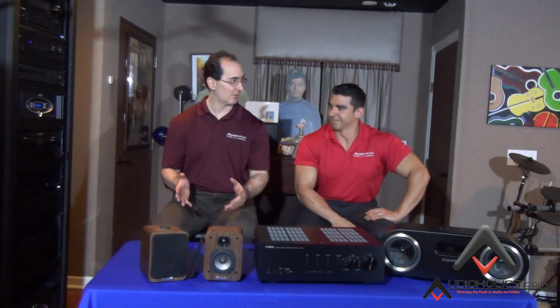We did not expect this kind of sound stage. They actually imaged. I didn't expect that from a Bluetooth speaker. But the freaking bass, dude. The bass was out of control. For a 3-inch little driver like that, in order to get that much bass out of a driver like this, you have to have a substantial motor structure inside of it, an efficient cone, tight. It's a very stiff, rigid cone. It didn't sound floppy or anything.